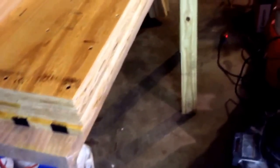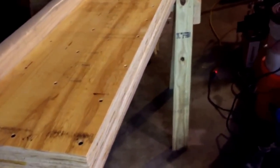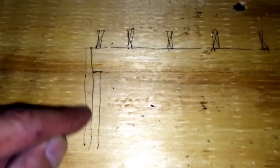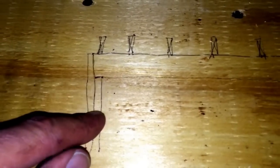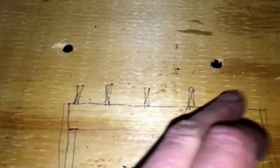I'm going to start a video on removing a supporting wall and replacing it with a beam. There are three primary means of supporting a load-bearing wall that you remove. The one you see most often, most traditionally, is a beam that carries the weight of the ceiling joists onto itself, then transferred onto cripple studs and a wall on either side to support that beam — the beam supporting the roof structure and ceiling joists.